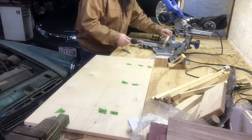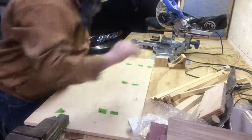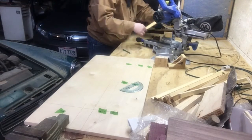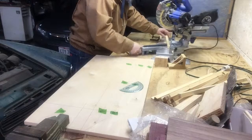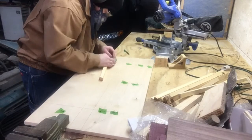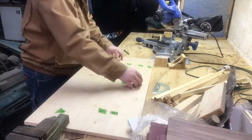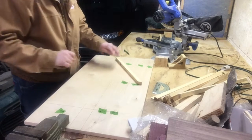As I was doing this, I realized I was having some difficulties with geometry. I even tried some potentially unsafe things to get that 60-degree angle, but realized better to be safe than sorry. I double-checked my measurements and confirmed this should be a 60-degree angle. It was very late, and I could not get it through my mind that I couldn't cut a 60-degree angle on the miter saw without a fancy setup or additional jig. The table saw cut felt unsafe too, so in the end I settled with rough-cutting it on the bandsaw and then sanding to the line. This ensured a nice, crisp angle.